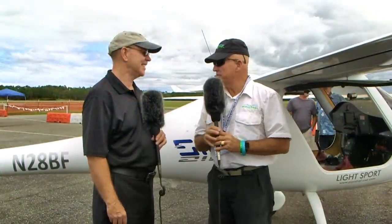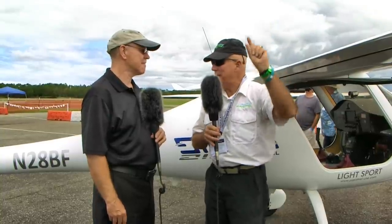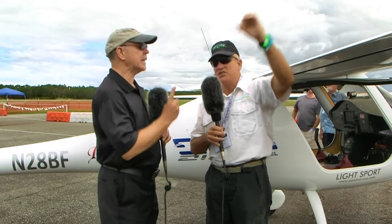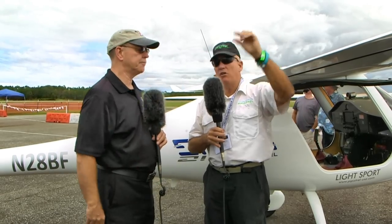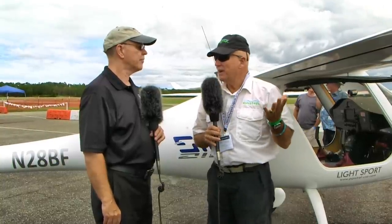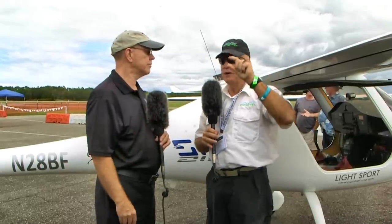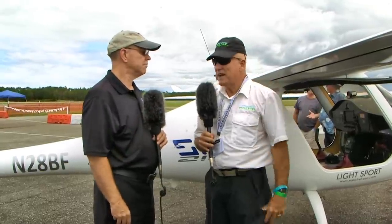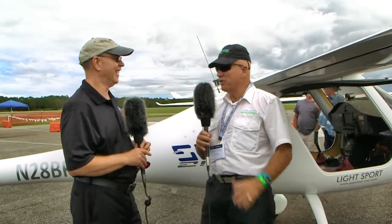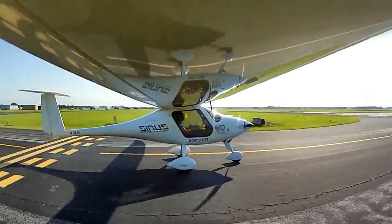You turn it seven times, then click it from the top to make sure it passes because it is spring-loaded. There's a hole in the top of the wing — make sure it gets up into the seating hole, push down on it, make sure it pulls out. Most of them have wingtip lights, and you clip a little wire — there's a cannon plug you release. So about 30 seconds to take a wingtip off, maybe 40 seconds to put it on because you're lining it up. When you get good at it, it's very fast.